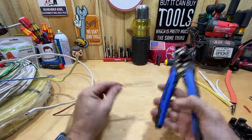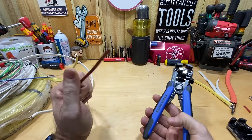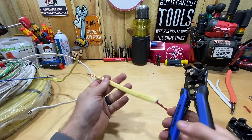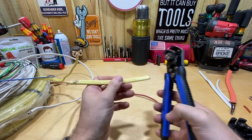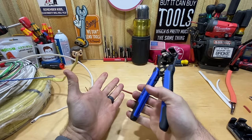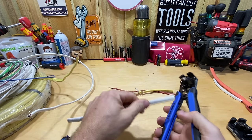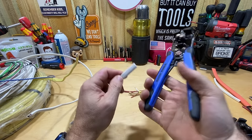Same exact features as the Milwaukee — now let's see how it performs. The Milwaukee's cutters worked fine on single wires but struggled with full Romex cable. Here with 10 gauge stranded, I stick it in, squeeze — cut through no issue, same as the Milwaukee. Where the Milwaukee struggled was cutting an entire 12/2 cable with three wires. Squeezing on that with the Klein basically feels the same — I still almost have to two-hand it. You could probably do it with one hand if you really squeezed hard, but I'd rather grab my diagonals.